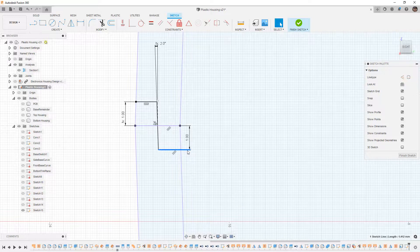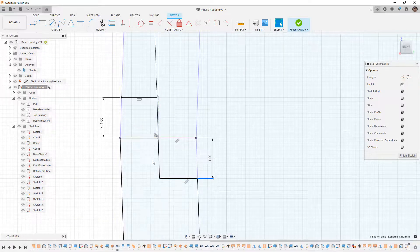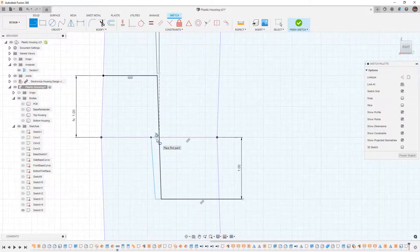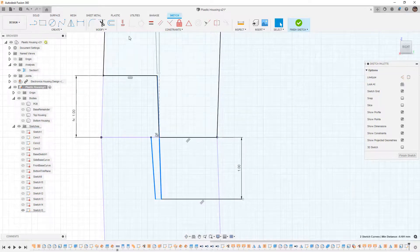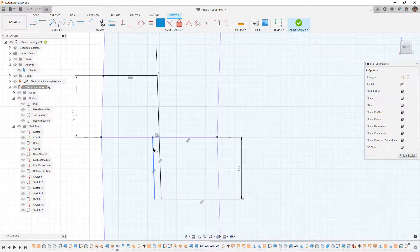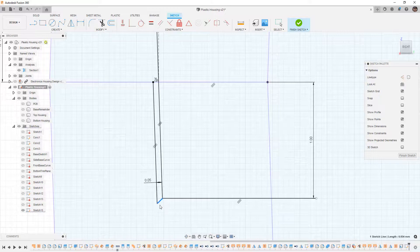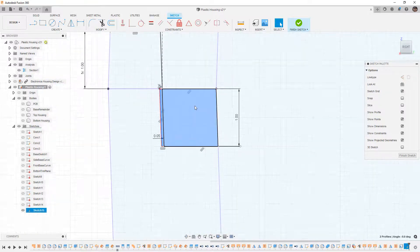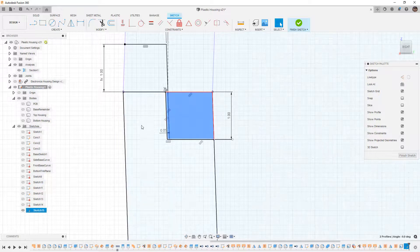This intersection — the horizontal line — that's fine; we can have them match there and that helps us control the squish or thickness between the parts. But we want to offset this cut a little bit. I'll use my line tool, carry this over and come up to that horizontal. I need a complete closed profile for the cutout from the bottom. I'll make sure these two edges are parallel to maintain the two degrees of draft, and then use D to give them a small distance of 0.05 millimeters — not half a millimeter, just 0.05. I'll make that bottom line horizontal to fully define the section. That profile is going to be the cutout from the bottom.